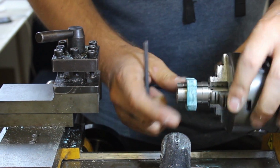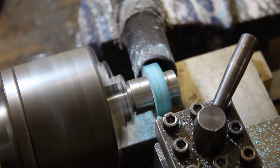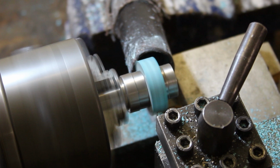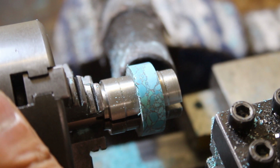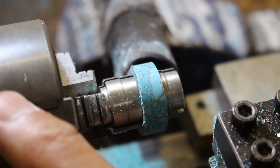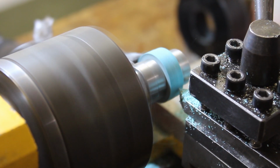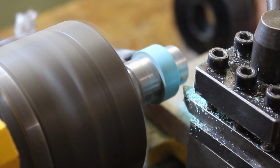Luckily for me, that was all the work I needed to do on the inner diameter of the Trustone inlay, so I just mounted it onto an expanding ring mandrel, which I coincidentally also got from ringsupplies.com. And then I was able to use a carbide cutting tool to zip down that outer diameter. I stopped frequently to measure the outside diameter with my digital calipers. And yeah, the carbide cutting tools just cut through this stuff like butter. It's so nice to machine.